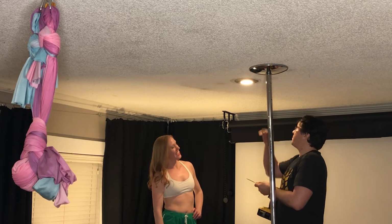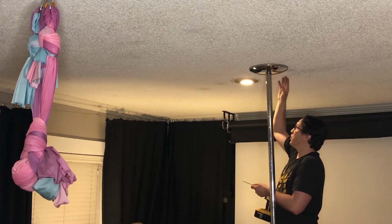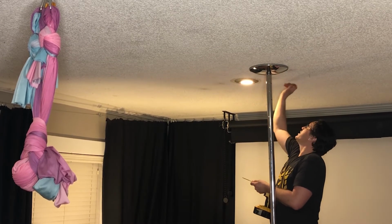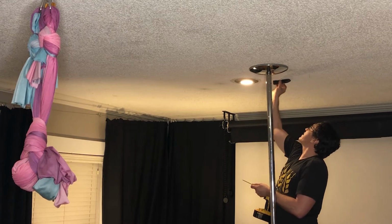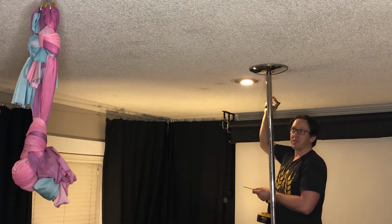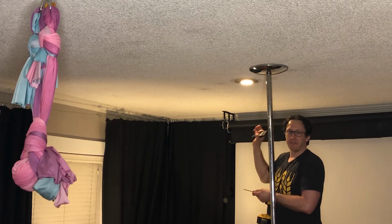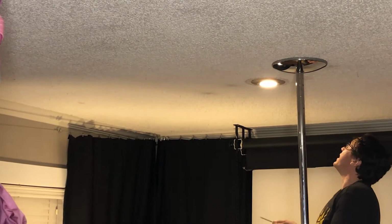So I already know where the electrical is, and I know that I am safe right here, that there's no power running directly here. I know that the ceiling joist is running along here. You can try to use various stud finders, like this guy, to try to locate a stud, and there's one, and coming from the other direction, yep, it's right there. So that can be the easy way if you're just installing a straight hook, which lots of times is enough for a hammock if you're not in a really large room. But for us,